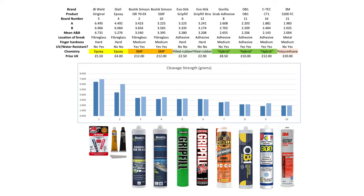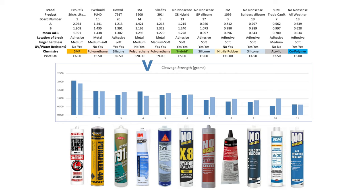The famous 3M 5200 — which some people consider almost too strong for anything but permanent fixings designed to survive an apocalypse — was odd. I used both the painfully slow normal version and the fast cure; they came quite a way down the scoreboard and failed by peeling away from the metal. I suspect they'd do much better in a fibreglass-on-fibreglass shear test. Also, mastic adhesive marketing jargon is really annoying — a few products where I've noted no UV resistance would probably do fine in the sun, but the companies have another product specifically for UV stability and so don't mention it in the data sheets.